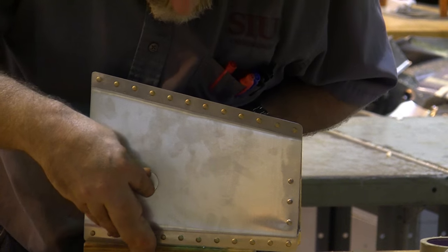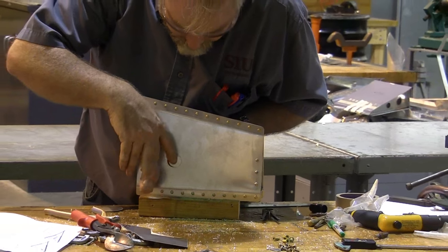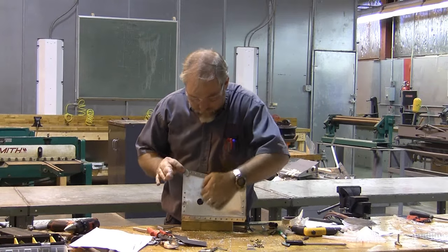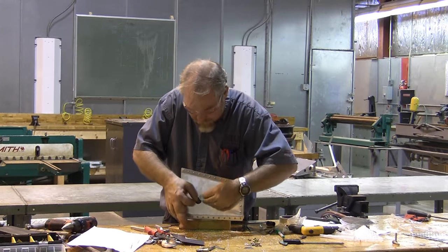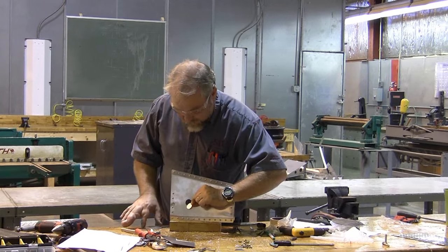One of the things that I find when I pull my filler out is I made my filler just a little bit too big because it won't actually sit inside. It needs to physically sit inside my circle. And it's better to cut this down smaller than to cut the circle bigger. Ideally, when it's done, there should be just enough width that I can get my thumbnail in between the filler and the other edge. So I'm going to need to trim this down a little bit.